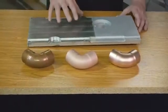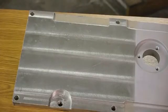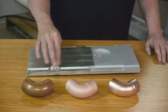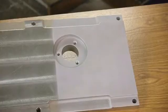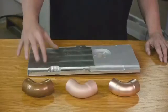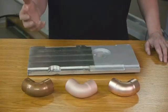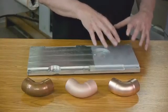This is where we really do well, and these are CNC machine parts. And you can see there's heavy tool marks. This is very common. You're going to see burrs in these areas here, and the wet blasting will do both. It'll deburr the part and it'll give you this finish. What they're doing out there, if they're not wet blasting, is they're hand deburring. So they'll come in here, they'll deburr all these areas, and then they still have to blast if they're going to anodize or plate to get that look. You've got to have this look in order to get a really nice looking part.